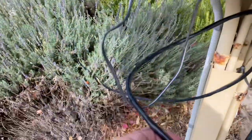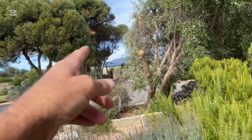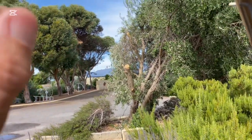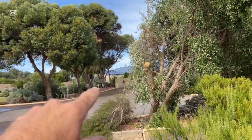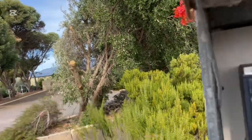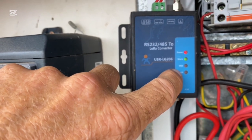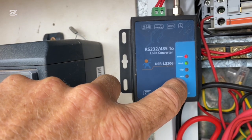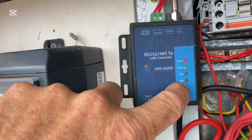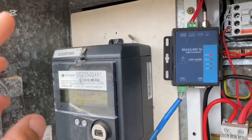On my second visit, I came back and bypassed the wireless bridge with hard wiring, and for the last two weeks the system's been working flawlessly. I spoke to Integralec, sent them some photos of the antennas, and they suggested we needed a bigger antenna on the shed. I've just done that, and as you can see by the LEDs on the device here, it's communicating really well now. Whereas before, it was just an intermittent transmission — that's what the LEDs are representing, transmission and receiving — and they would only work intermittently, and the energy meter would appear on the screen of the inverter intermittently.